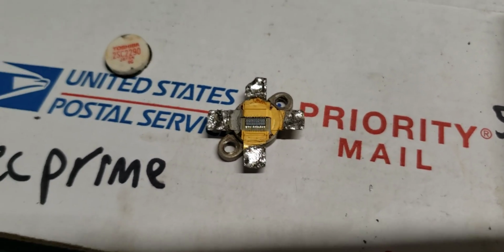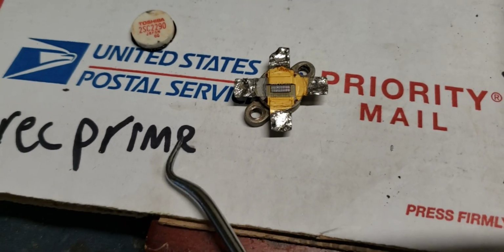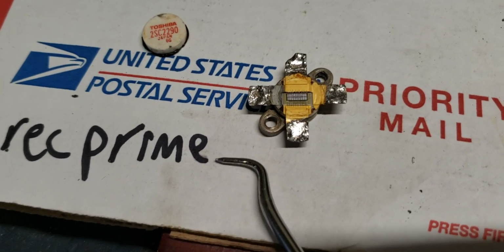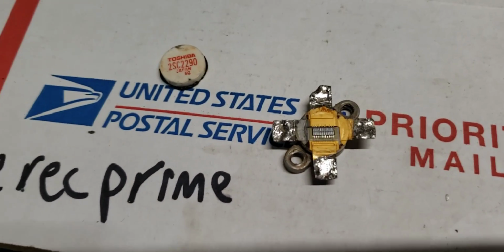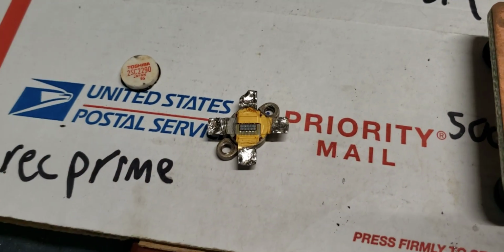And if all the heat isn't transferred equally, that's why we use the heatsink compound, to fill up all them micro spaces. So there you go. That's why we use it, to help the heat disperse equally through the heatsink.